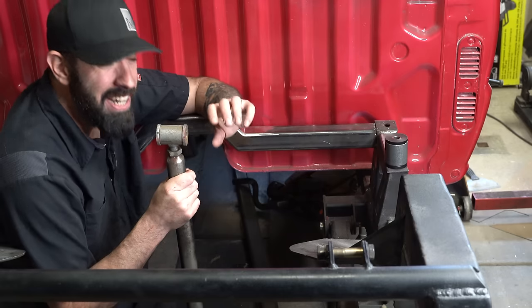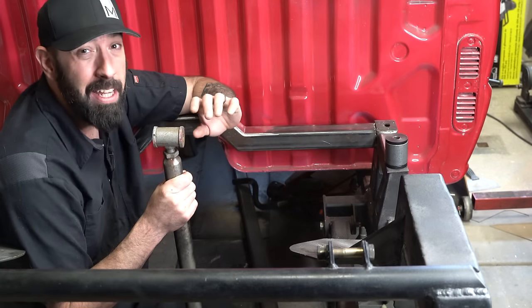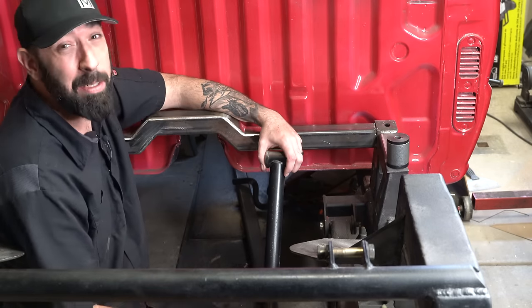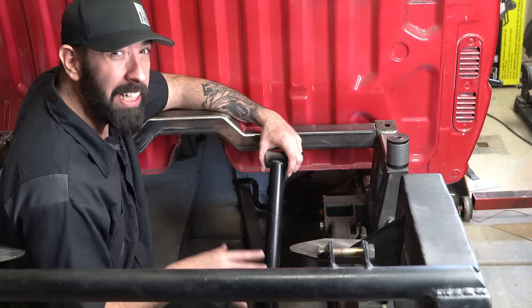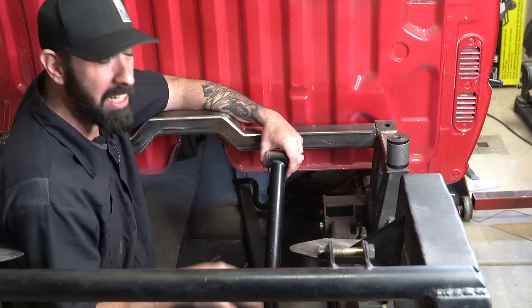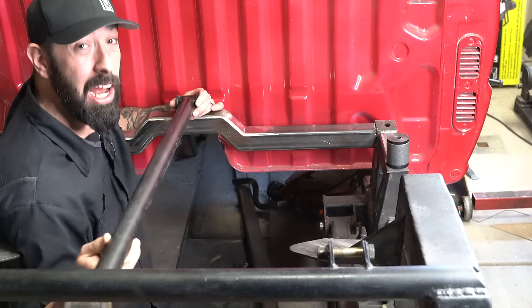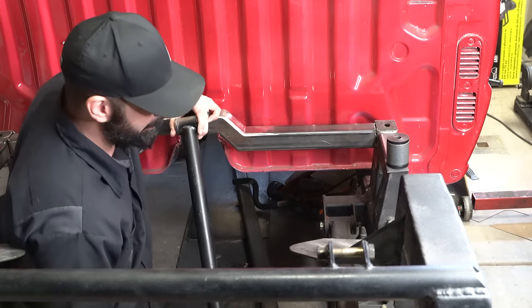Non-load-bearing link bars are not as important. However, I would still suggest you keep them as wide as possible. With the lower link bars set as wide as they can possibly go, the width of the upper link bars aren't quite as crucial. In theory, all we really need to keep the axle from rotating backwards under acceleration is a single bar right in the center. I wouldn't recommend it because that could potentially take away a lot of the axle stability.